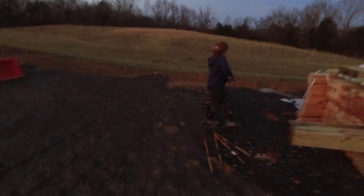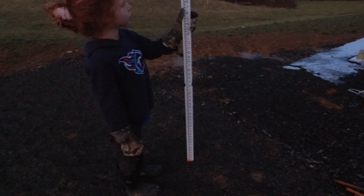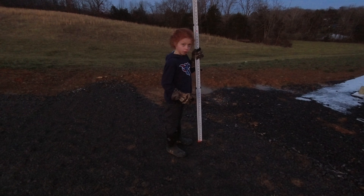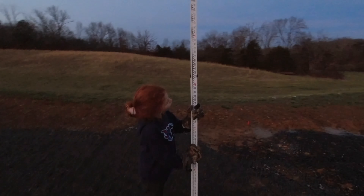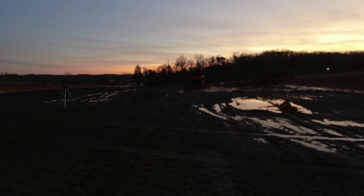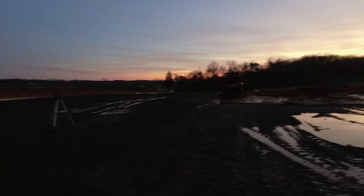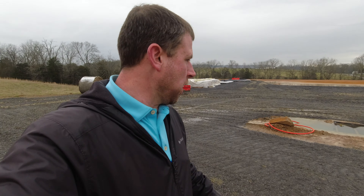Alright, Palin. That's four, one and a half. Let's go right over here. Set it down about right here, Palin. Hold it level, plumb. You're at four, so you're just about an inch high there. Scoot it back — it's piled up a little bit, back towards you a foot. Right in there. Now level your pole up. What kind of reading are you getting? I think it's one. We're at four one, pretty much. Four, one and a half is what we were at over on the corner, so we're pretty well good to go. We're going to go off that front corner and have them hold it up about five inches off of that corner, and then we can make everything else work.